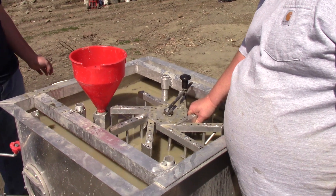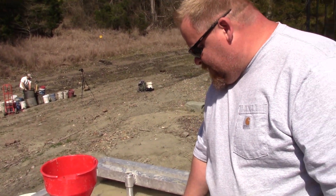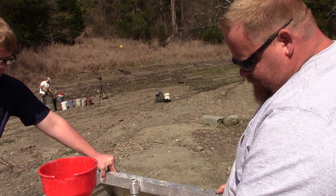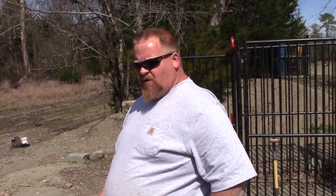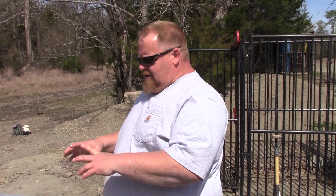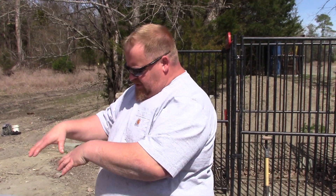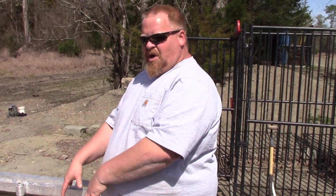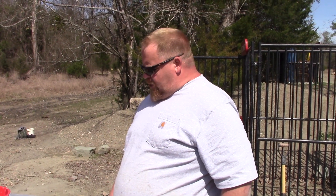This is our first year with this machine. We got a little bit done with it yesterday because I took the trommel out already — this is our last day here. The trommel sits on top of this and the whole thing just comes right off. For people who aren't familiar, a trommel is a rotary drum. A lot of people just have single ones where they put material in, tumble it, and it washes all the silt off. Mine is a dual drum: I have a quarter-inch screen on the inside drum and a 16-mesh on the outside. It has two discharges and sorts material by size. All the water and silt goes out the bottom back into the tub to be recycled. One chute dumps everything larger than a quarter inch, which we just look at on a table, dry out, and toss. The other handles everything between 16-mesh and a quarter inch — that's basically what we run through the Soruka machine.